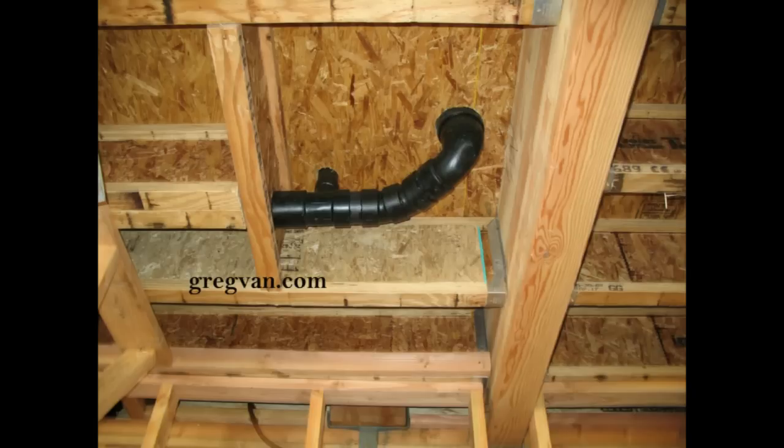If the head-out method works for you, go for it, but it will require a little more lumber. Most people jump right to heading things out, but realistically if you slap a couple of joists on either side of the bay and remove and reuse the existing joist, you're only going to need one additional joist to make it work. If these videos help, hit me with a thumbs up — always appreciated — and stay tuned for the next video.